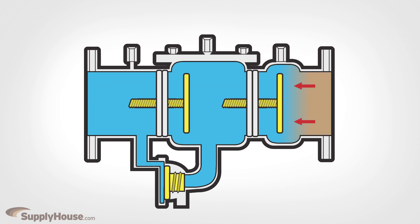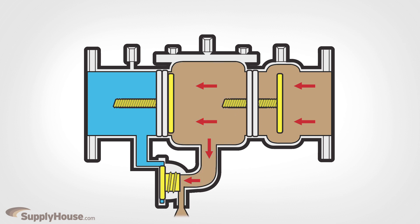At the arrival of back pressure, the check valve will shut and seal the contaminant in the plumbing system. Some units will then drain the backflow out while remaining sealed. If the check valve is to fail, then the central chamber will collect the water and the second check valve will activate. Due to the reduced pressure, this chamber will be able to stop the contaminant and expel it into an air gap drain.